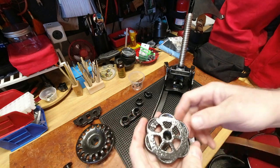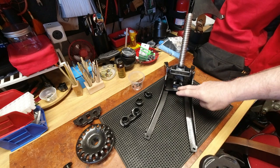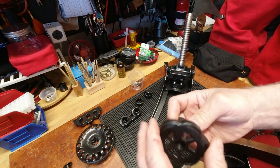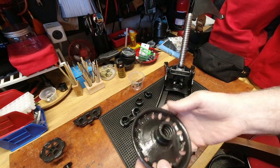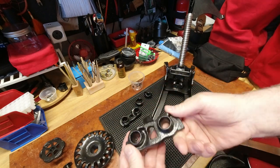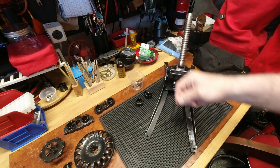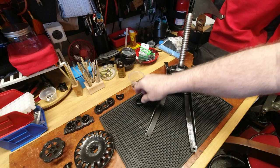Again, all the hardware was bead blasted down to, I think, I'll show a picture of this because I did the bead blasting of this. This was the worst, obviously, of them because of its size and intricacies. But I got them down to probably 90%+ bare metal. And then shot them with the hammer spray, which I think came out really nice. And I think we'll have a nice complimentary look of old school. It's nice and clean. All the parts, again, very clean and newish.